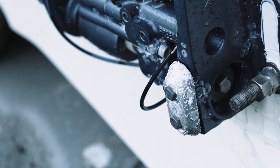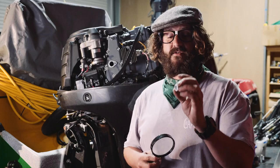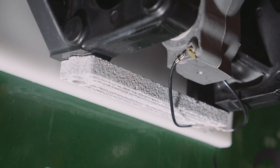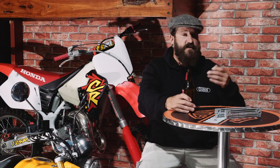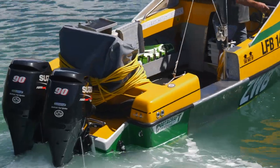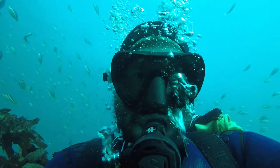The other way to manage electrolysis is by adding a third metal into the circuit. This one gives up its electrons easily. This selfless little part is called a sacrificial anode. In technical terms, it's an electrode and electrodes love chewing current. Our outboard engines act as their own little conductor, creating a negative charge, while the saltwater creates a small positive charge — and that's when electrolysis starts.